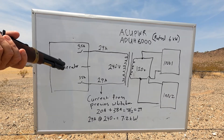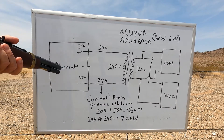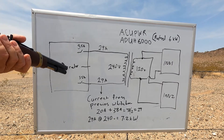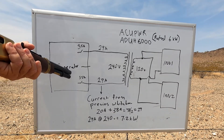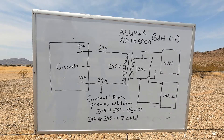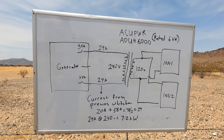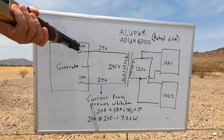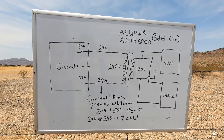With a generator — as opposed to an inverter — each phase comes off a different part of the stator coil, and being something of a perfectionist, I really want that stator coil operating in a condition of full balance rather than having unbalanced magnetic fields around it. I've learned a lot about the reliability of stator coils and done other videos on the subject. This is one of those purist things I'm really glad to see, and it allows us to tap the full ability of the generator. The solution is pretty simple — just a great big transformer — but you can't kid around with the quality of that transformer.